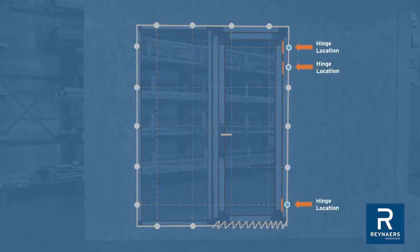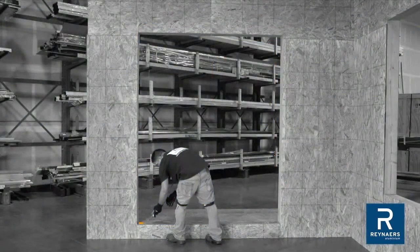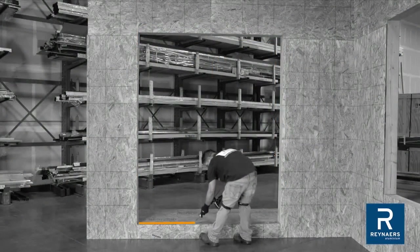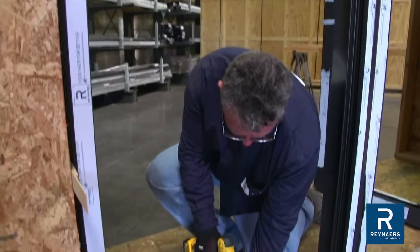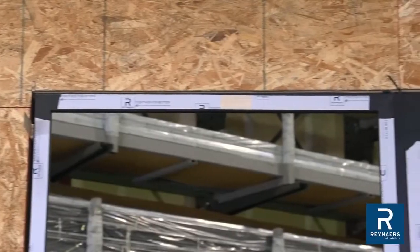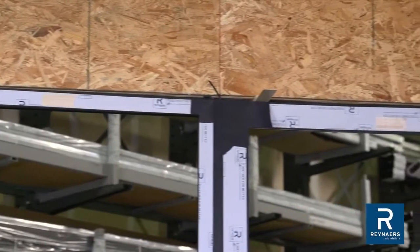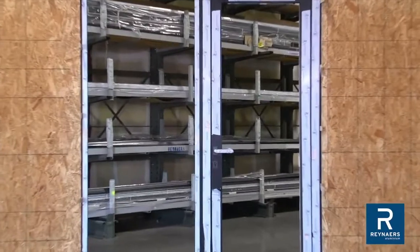Always locate connections at the locking point and hinges. When a coupler, transom or mullion is used, it is critical to locate attachment points 8 inches maximum from the intersection of the connecting profiles. Do not pierce the sill chamber to avoid water infiltration through the bottom of the outer frame. Embed the door threshold in caulk to adhere to the substructure below. Utilize fixing lugs to secure the bottom window profile of adjacent elements combined with the coupler. To allow for expansion and shrinkage of the elements, use minimal shims at the header frame.